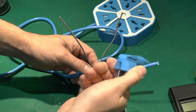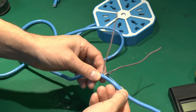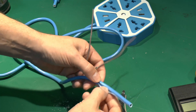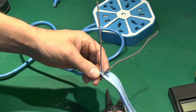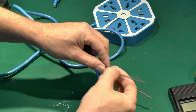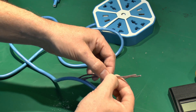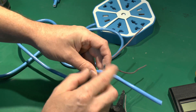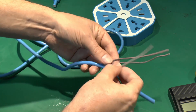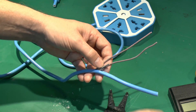I'll just remove this plug because I don't want to use it for the high current test - if it melts it'll destroy the sockets. I've just stripped off the insulation here. What we've basically got is this blue, fairly soft plastic covering. Inside it's full of white powder, presumably asbestos or chalk or some other toxic waste. Two conductors of that browny coloured material we saw in the previous video - very dull appearance and not in particularly good condition. There's some kind of damage mark on it. The third piece isn't actually a conductor at all - it's basically just a hollow plastic tube, presumably as a filler to give a more round shape. So there's no earth wire there, so it couldn't have been connected even if somebody wanted to.